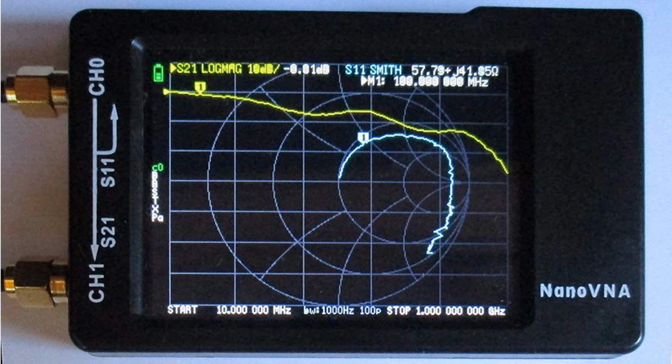Anyway, as the SWR at the middle of the band was less than 1.1:1, I accepted the current situation without going for any retuning by lengthening the antenna, which would be more cumbersome than trimming. To prove my theory, I will have to reintroduce a corresponding inductor in the antenna circuit and test again. As I do not have a nano VNA or any other antenna analyzer, I decided to try out the current setup for some time before making any further changes.